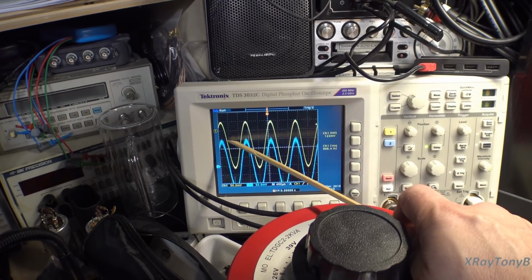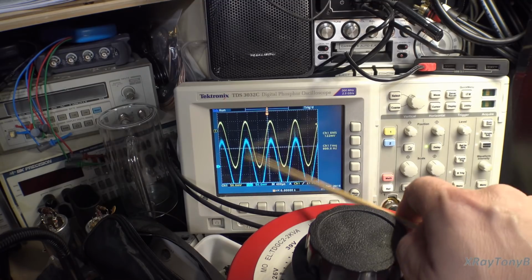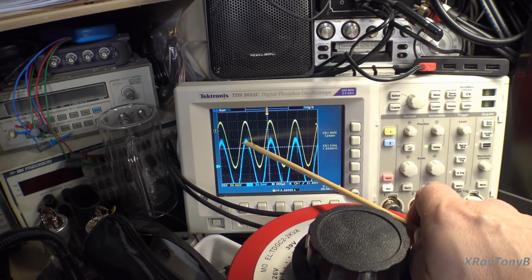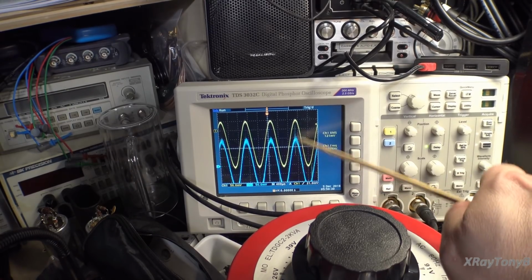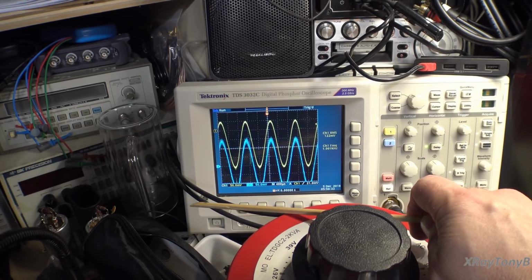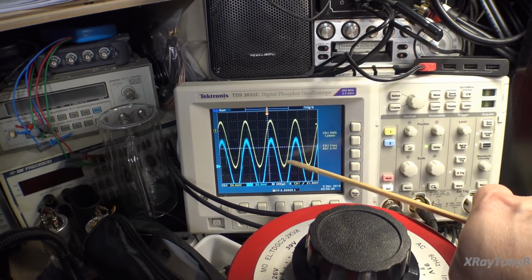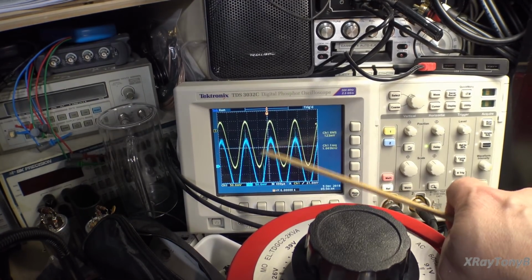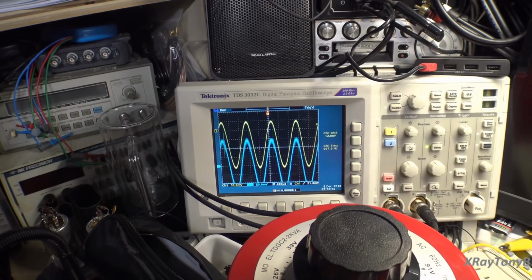It's holding it perfect, but you're getting a little bit of DC offset. Now, this is only millivolts of DC offset. It's not going to hurt the speakers at all. But if you notice this one, the servo's actually holding this one much better on the channel with the replacement transistor. But if you notice all of this noise, again, I believe this noise is coming from that substitute transistor I'm using. Now, this noise probably would not be audible to us because this is such a tiny little signal, and as soon as you turn the drive up a wee little bit, it straightens right out. But you can see there is a difference between the two channels. So I just thought that'd be an interesting thing for you to see.